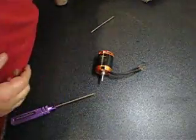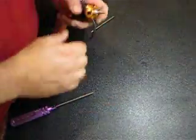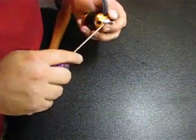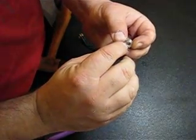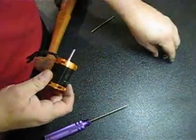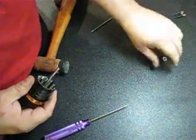What I'm going to show you how to do is rip this motor apart — very easy to do. First, remove the collar; there are two allen screws there, loosen it up. Notice there's a little lip there — the lip rests against the bearing. For the guy who says it's alright to fly without the collar, this is what happens. That's without the collar.